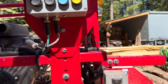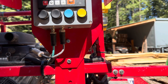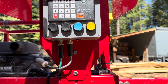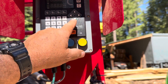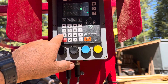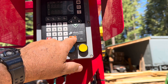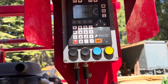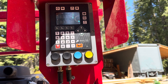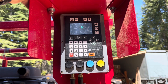And you wanted to — it wasn't an overly big log, but maybe you could get two more two by sixes out of it, and then you're going to go an inch and a half on top of that cant. So you would use the plus symbol: one and one half, plus one and one half. That's going to give you three boards and you need to be eight and three quarter inches tall. Push the enter button, it takes you up to eight and three quarters, so you could cut your boards.